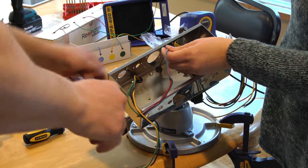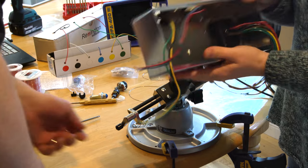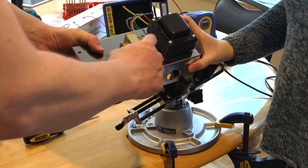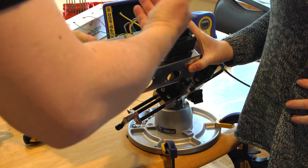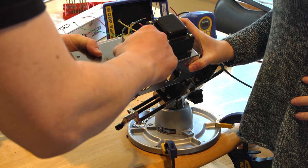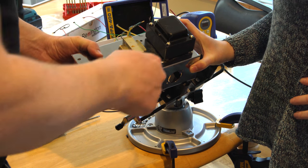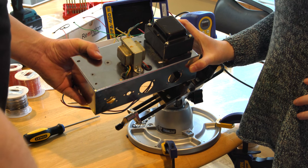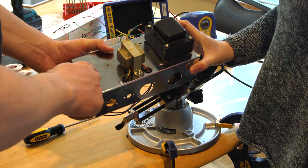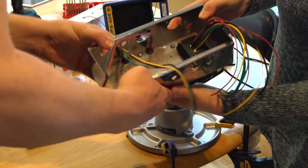All right, let's quickly remove it and turn it around. Now, if you look — this transformer looks just like that one but it's rotated upward and turned sideways. This side here and this part here are turned sideways from the other one. They also have a good amount of separation, so they'll cancel each other's fields instead of reinforcing them. If for some reason we're getting too much noise we may need to adjust and move it over a bit, but I think we're fine. Let's go ahead and put this back in.